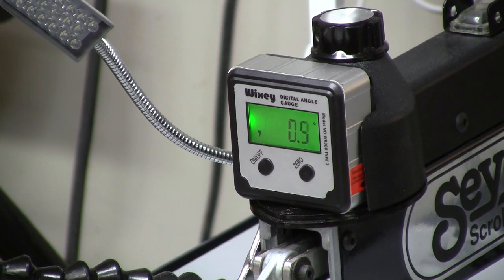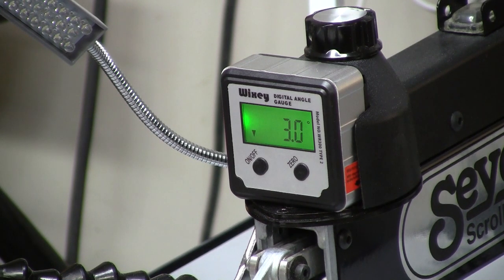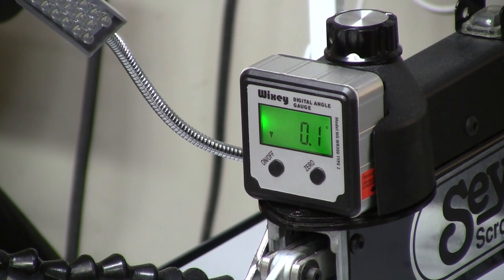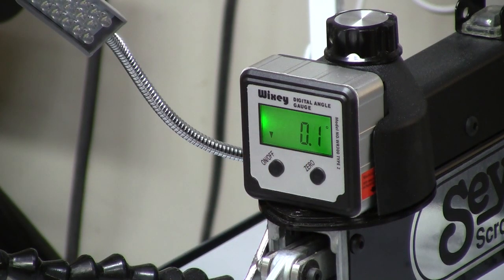The gauge takes about half a second to a second to react, so when you're trying to zero in on a specific angle, move it a little bit and wait for the gauge to settle before continuing. For example, sneaking up on 3 degrees — give it a small move, wait, and there you are at 3 degrees. Underneath the table there are positive stops that you can set anywhere you want, letting you come back to zero reliably. This gauge is probably accurate to within a tenth of a degree.